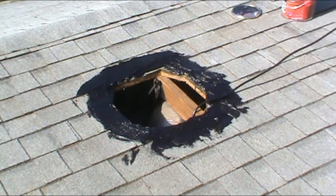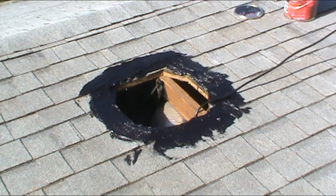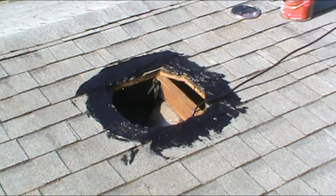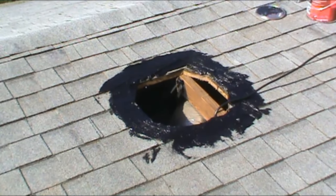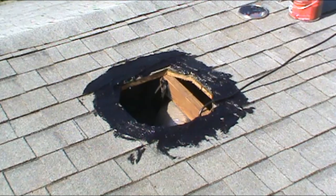What I've done here is I've put roofing cement down before I put the flashing down for the fan. Now, I know you're saying why didn't I tear up some shingles and put it under the shingles? Well, in the very near future I'm hoping to have a metal roof on the whole house. So the flashing is sufficient and the roofing cement is sufficient until we get the new metal roof on the house.